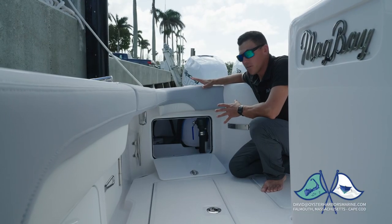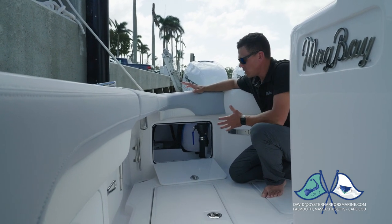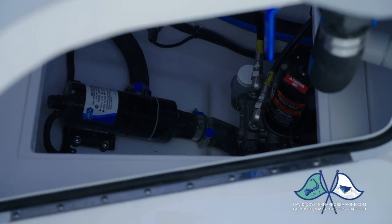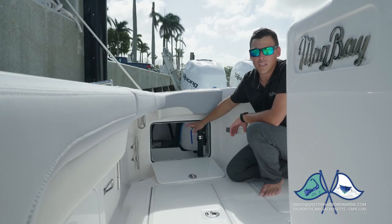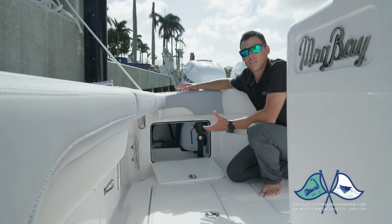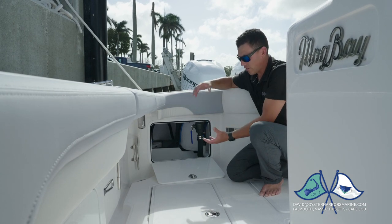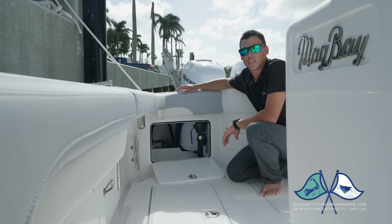On each side of the boat, outboard of the bait tank, we have a storage locker. This is one spot where you can see how we put the boat together — everything on the inside is finished gel coat. We go back in after the fact, clean everything up and finish it off. Also, aft inside here you can see a box that has a whole bunch of through-hulls. Instead of having a whole bunch of through holes going out the side of the hull, we've designed our own box where everything drains into this box and drains outboard through one hole in the side of the hull.